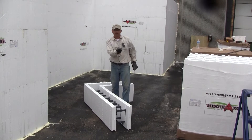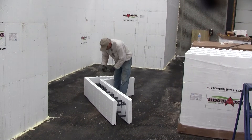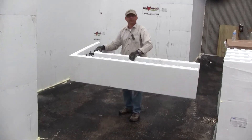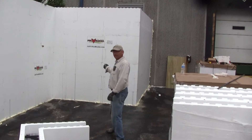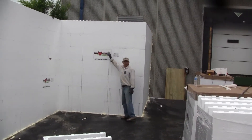We're using these wire HV clips, the Fox Blocks HV clips, and we're clipping them on. I'm actually putting two clips on to hold this together as one unit. We just built this entire wall doing that principle, and you can see here we did this one seven rows high, and all of these joints have stayed together quite well.